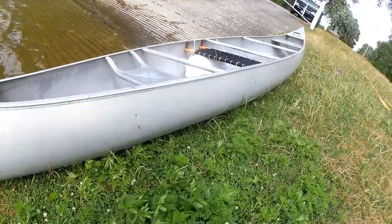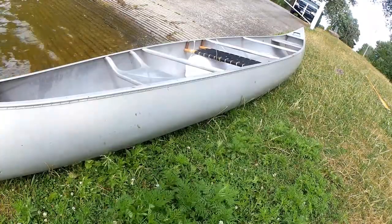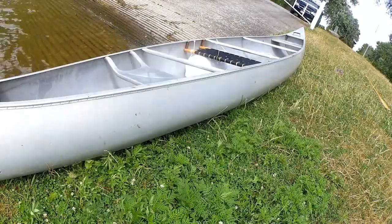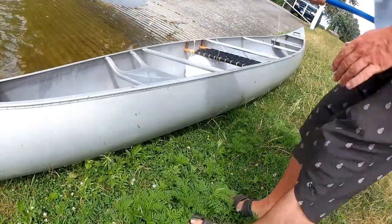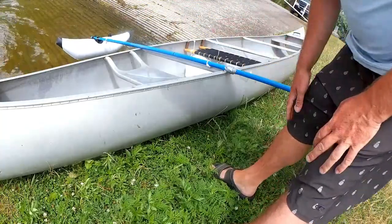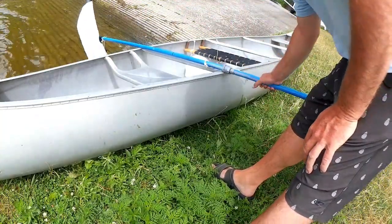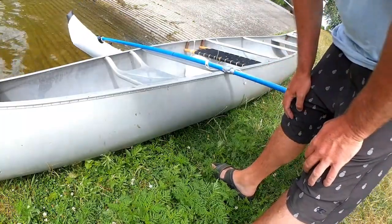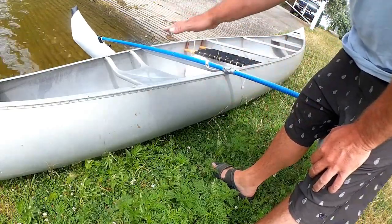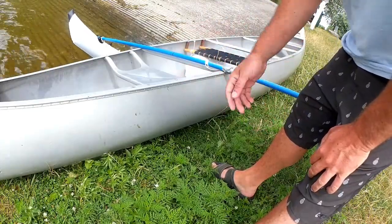To attach them, I'm just lashing them so far, although I'm going to switch to U-bolts. The lashing seems to have worked for the sailing I've done so far. I'm putting the eight-foot crossbar on the front thwart and lashing it. With the eight-foot crossbar, I'm getting about 170 pounds of extra righting moment in addition to the canoe's inherent stability, so it's a substantial amount of extra stability.